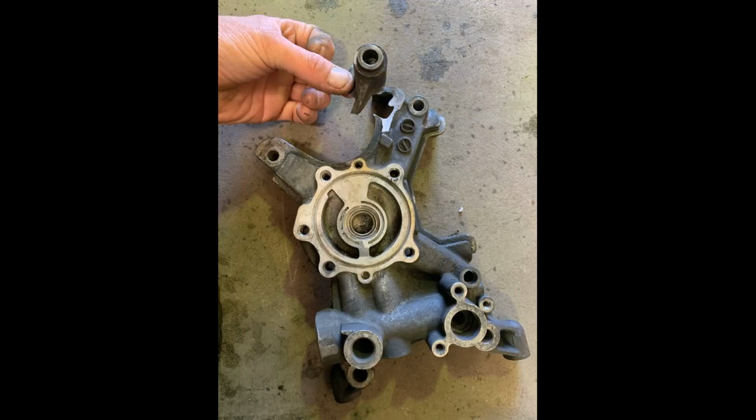Right, anyway, today's job, hydraulic fan pump. I had a message from a friend of mine. He's just airbagged a truck, and it's another workshop, and he said, have you got one of these? Quick chat, and this particular vehicle's got Gilmours on it, and I've fitted a few Gilmours to 1UZs and they break the top idler point because there's just too much load on it. So we normally get in and we weld up the back of it, put a bit more strength into it. However, Simon's going to need a new one or a replacement.